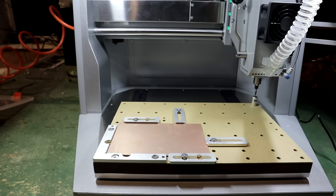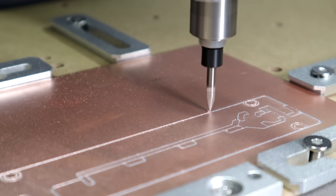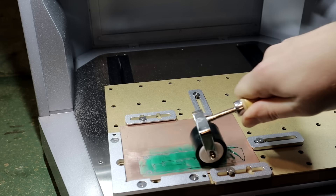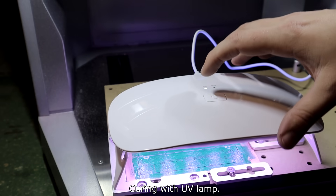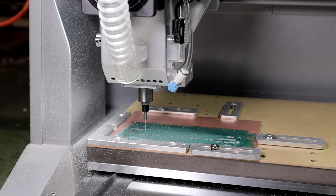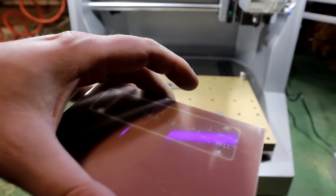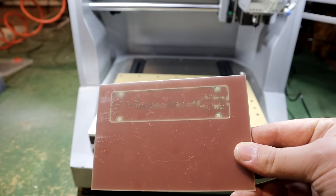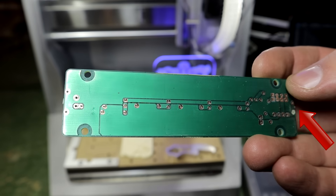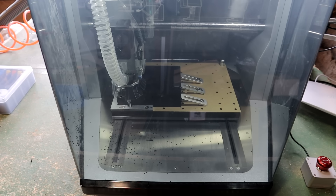The first thing I tried was to make a PCB. The first task is engraving the copper layer, then sanding before applying UV soldering mask, which also comes with the PCB fabrication pack. The first one I did had problems — it was not cut all the way through. I then noticed I used a different board than shown in the guide, and I also didn't use two screws when fixing the board. I used a different board and almost got it right the second time, but when removing the mask, it cut off the copper layer completely at one connection. These boards can easily warp. I think it was not the machine's fault; it could be a board issue. But overall it came out quite nice.